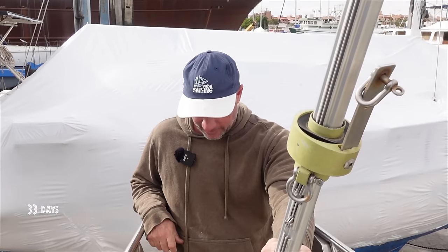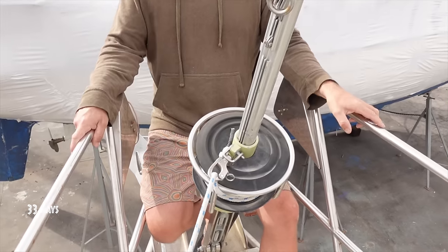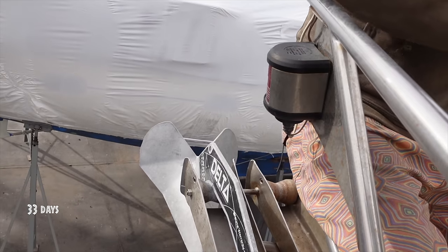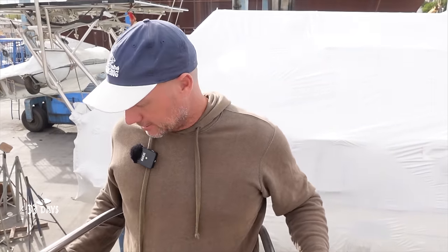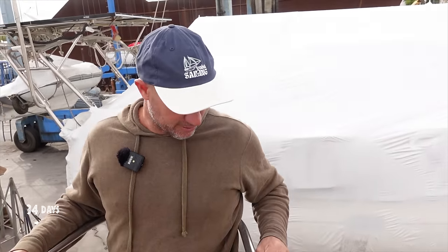One of the other jobs is a little chair for Sarah to sit while we're sailing — we'll see if we have time. What we do need to do is fix the two navigation lights that aren't working. I have plenty of wire so it's a matter of checking connections, running a new wire down into the anchor locker, and attaching them. Probably three hours, soldering or heat-shrinking new wires, making it all waterproof and clean.